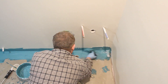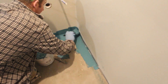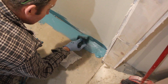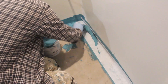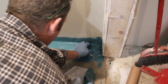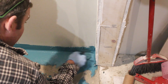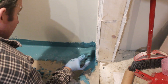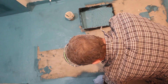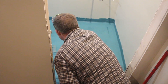We're filling in on the main bathroom floor here. As Steve stated, it's really important to add the fleece to the corners — this simply protects any water that might leak out of the shower. We're doing this on all of the walls within the bathroom. The KBRS liquid waterproofing membrane is also an isolation membrane, serving the same purpose as a DITRA or DITRA Heat product, helping to prevent tiles from cracking when set on top of the concrete floor. We're filling in around the pipe coming out of the floor for the toilet, using a paintbrush for that, and then rolling on the rest of the waterproofing with the 3/8-inch nap roller and working out of the bathroom.